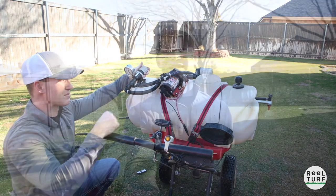That's what it was — just these hoses were letting just enough liquid by to keep that pressure from staying consistent. Sometimes you get lucky and it's the simple things that fix the big problems — just a little bit of rubber hose and some clamps. When you usually have a problem like that you think it's going to be expensive — you've got to replace the pump and all the most expensive items. Let that be a lesson learned: sometimes just start with the simple things, slow down, think through the process, and think about what each component is supposed to do to help you troubleshoot before you jump to replacing expensive parts.